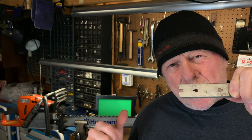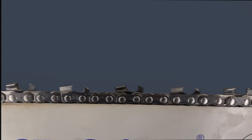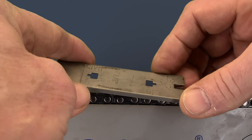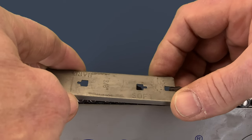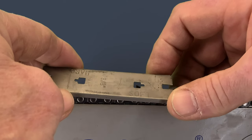Make sure that the cutter top plate that belongs to the raker is touching, so that you have a nice tight relationship between this raker, the top plate, and the links in front of the raker. Let's watch the video — I'll show it to you. Short video tonight, folks. So all I really want to demonstrate here — there were questions about how this gauge is positioned, because in the previous two videos I didn't really focus on placement of this too much. But today I want to clarify that.